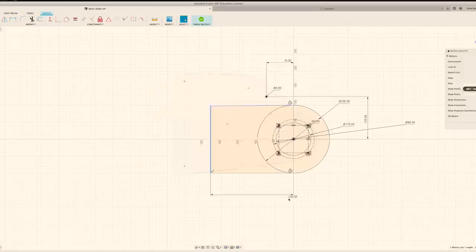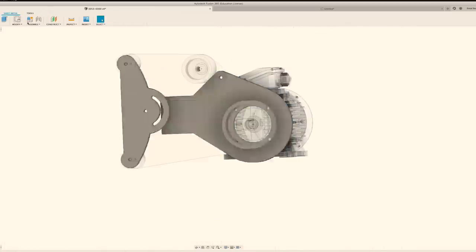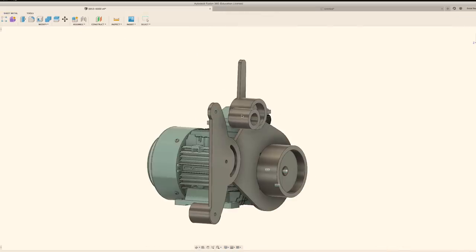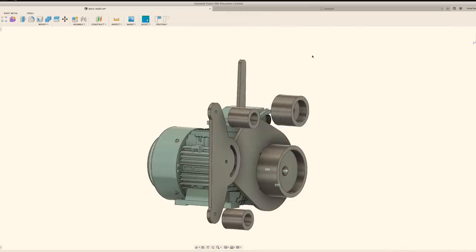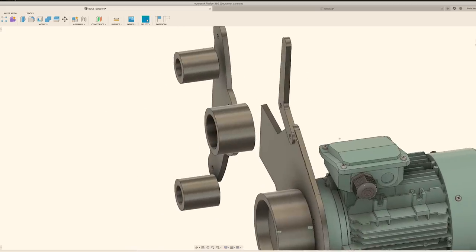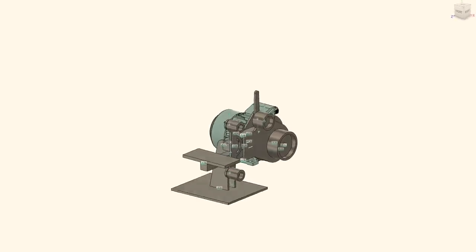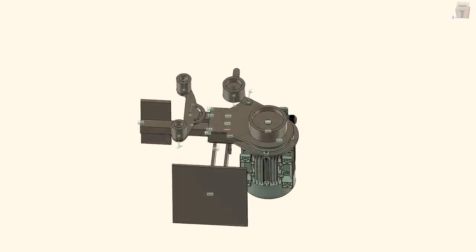A bit of research told me that for steel you want a belt speed between 20 and 30 meters per second, for plastic and other heat sensitive materials it's obviously a bit lower. A quick calculation told me that a 3000 RPM motor with a 5 or 6 inch driving wheel would be the way to go to reach the higher speeds. Combining that with the motor on a VFD also gives me the lower speeds.